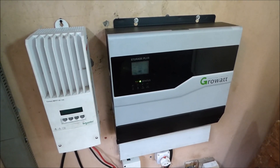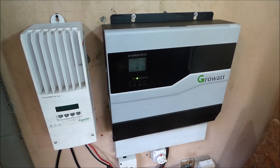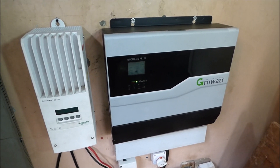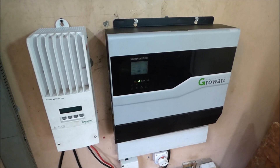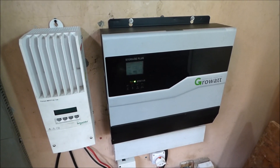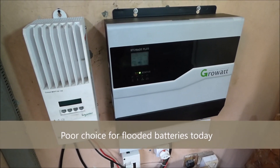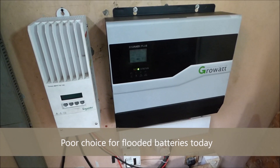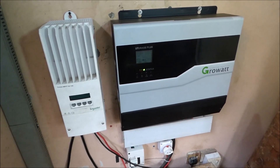When it comes to the basics of what an inverter does, this does it very well. Now let's discuss the limitations. If you're running a Growatt lithium battery, it's perfect. If you're running a gel battery, it's good — not perfect. If you're running flooded batteries like we do, as the inverter stands, it is a very poor choice.